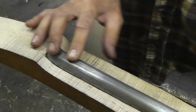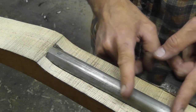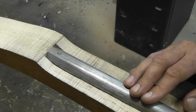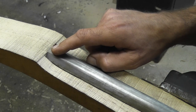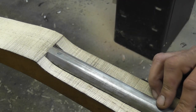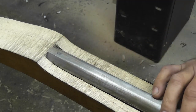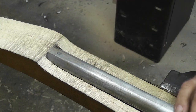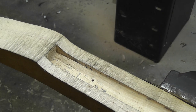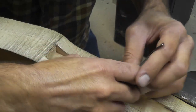The breech area can sometimes be deceiving. If you're hitting, you might be hitting up in here in the inlet. You can tell when you lift the barrel out by the muzzle — the breech will tip down a little bit, and when it does, it'll print just like that. It'll print back here, but it's not hitting back there, so you need to be careful of that. It's looking a lot better now. We're getting printing all over the place. I'll scrape our high spots down again.